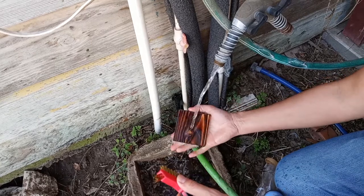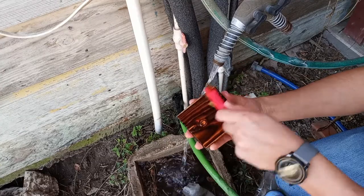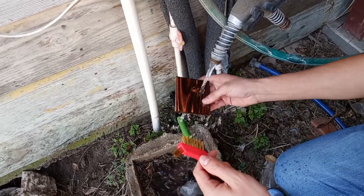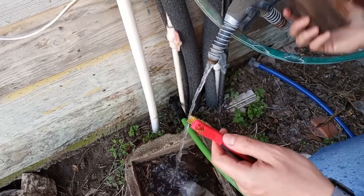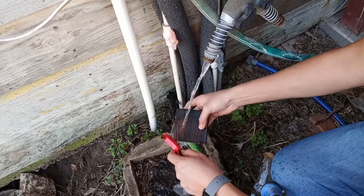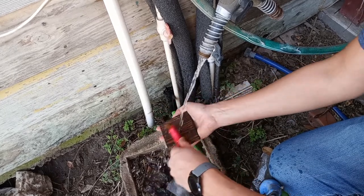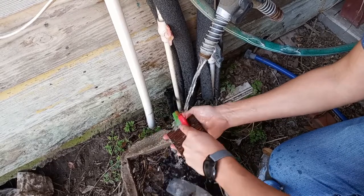Scrubbing leaves behind some darker spots and some lighter spots, and that transition of the two shades on the grain of the wood gives it that nice look. When scrubbing, don't scrub against the grain because you can end up with surface scratches that will be visible. Scrub with the grain — you don't have to scrub too hard or too long; it's just to get a small amount of excess char off so it doesn't come off on your fingers afterward.